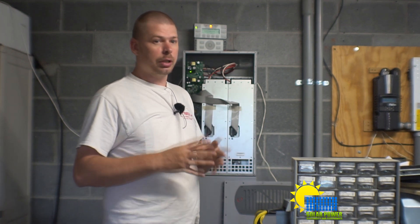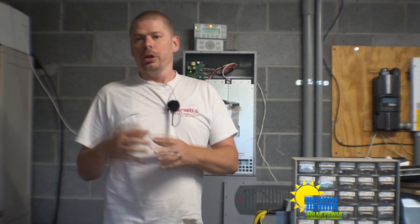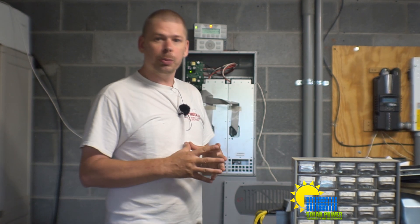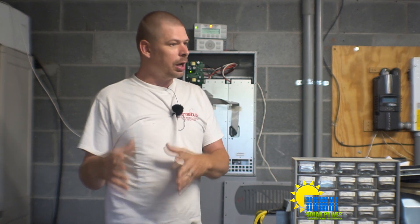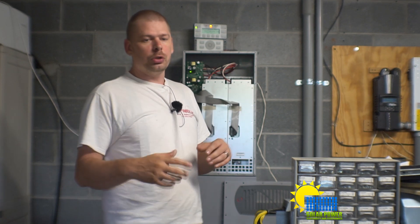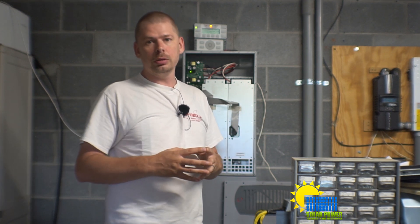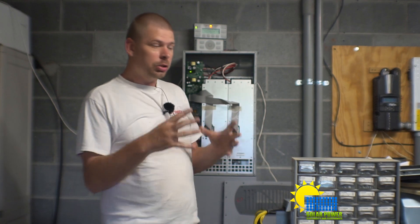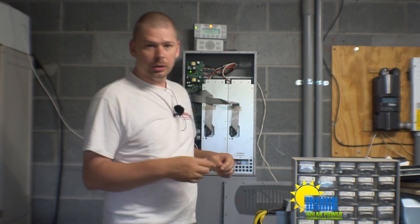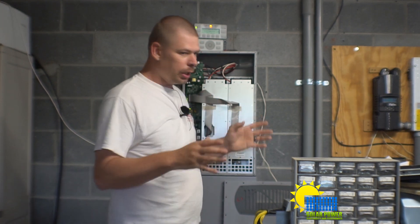It took a little while to get that balance. I just added a little more power after I tried to balance things, but I've learned over time that my house is not totally perfectly balanced and I'm pretty disappointed with that. There's not a lot I can do unless I redo all the wiring in the house — at least the refrigerator, dishwasher, the mini stove, and the window air conditioners are all on one circuit. By putting that heat pump in on 230 volts, that'll balance it.